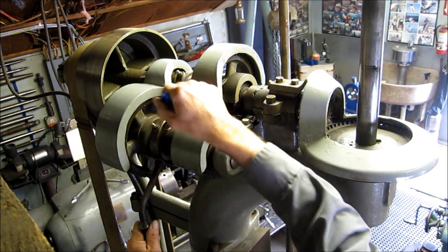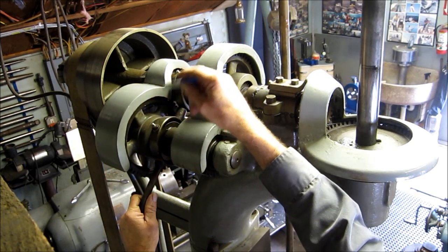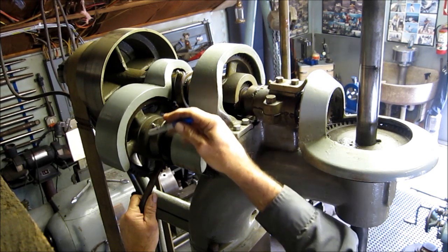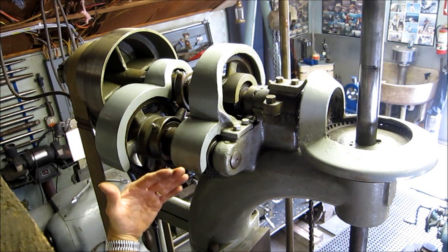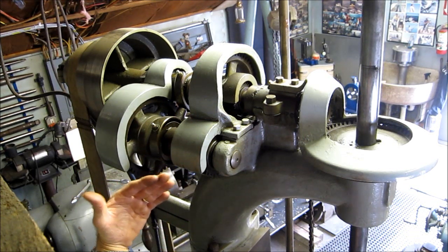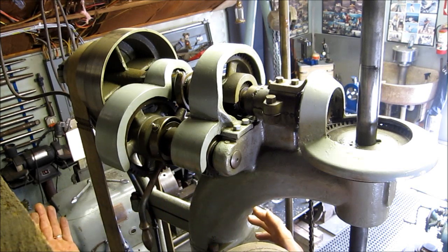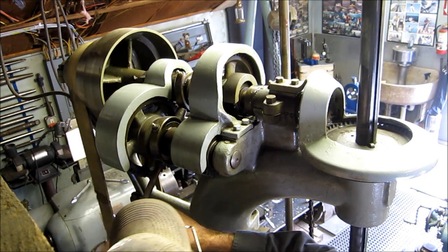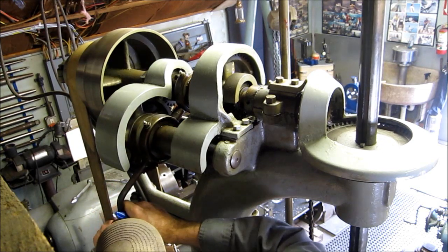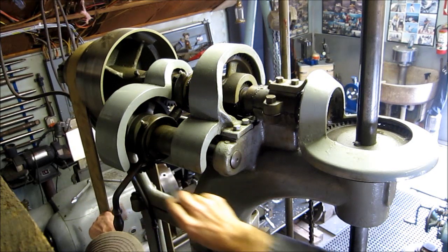As these two bypass each other they have to come in and out, so I have a slip joint — two tubes with a spring inside. When they bypass each other, under its own spring tension it holds the gears engaged in both positions. There's a direct drive there, and then sliding the lever over you disengage the direct drive and engage these two gears here.